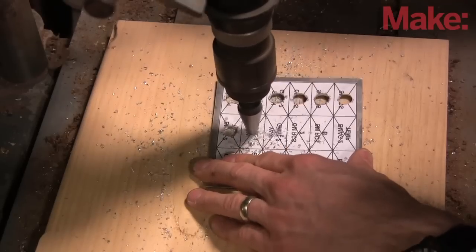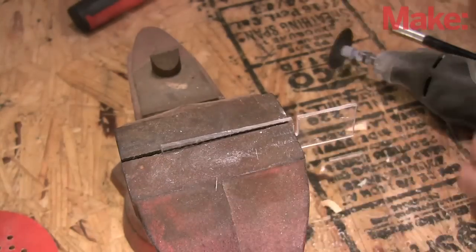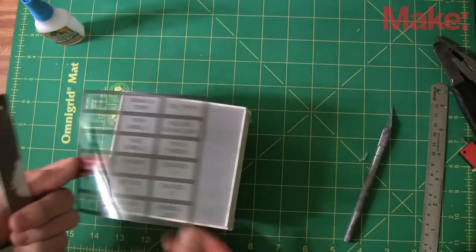For my status indicator panels I made LED holders out of aluminum. I cut dividers from plexiglass and notched the dividers with a Dremel so they would slot together, put reflective tape on the dividers, and mounted them under a diffuser I made from a cutting board.